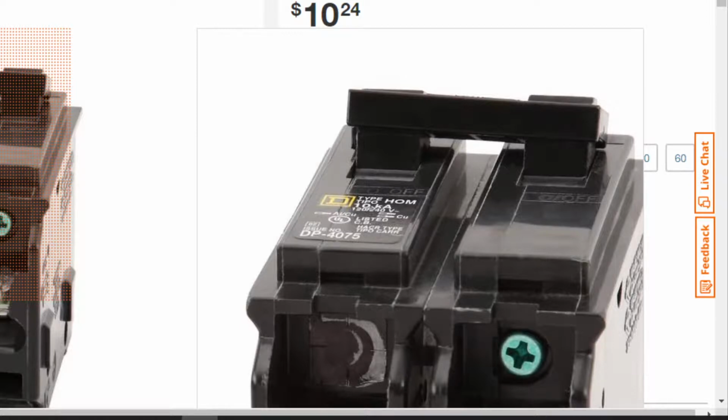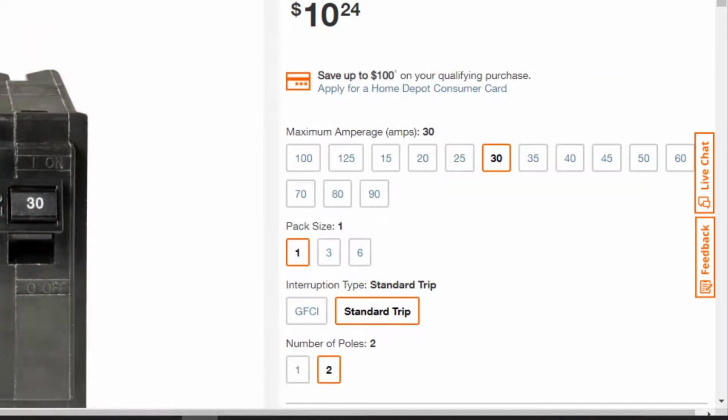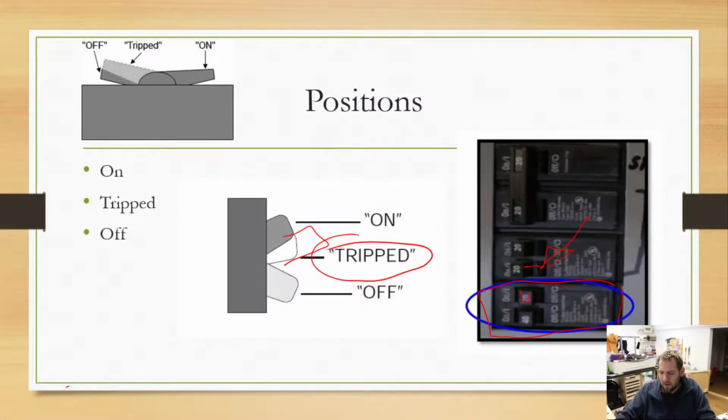This type of double breaker that's 2 breakers wide is meant for 220 volts, or that higher voltage, maybe 240. Whereas that double breaker that is in our presentation down there is a single breaker wide with 2 different breakers on it. So again, this circuit breaker that I was showing you is rated for 30 spaces but 60 circuits, which means you could put 30 double breakers in it, like what we're showing you on the screen. What you see in this PowerPoint, you could put 30 of those in, which would get you 60 different circuits. But it's only meant to handle 200 amps.